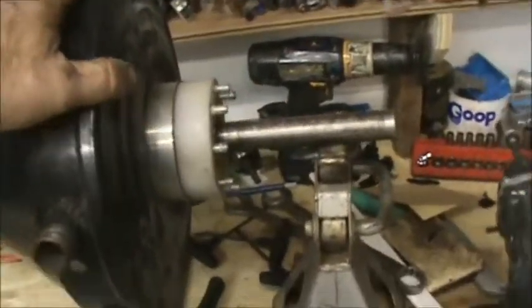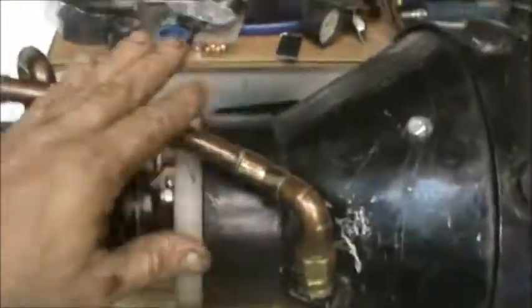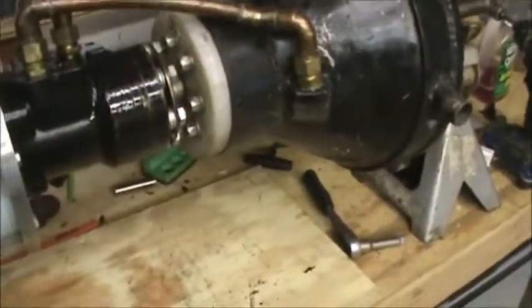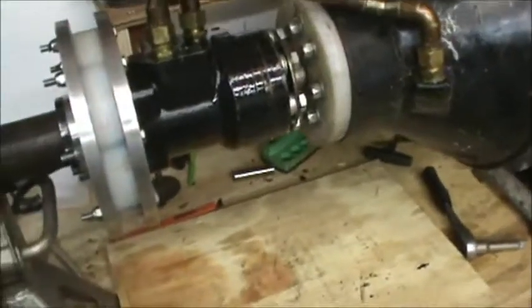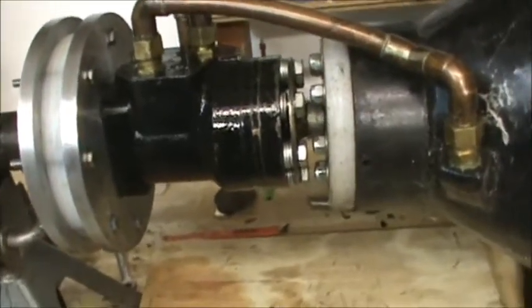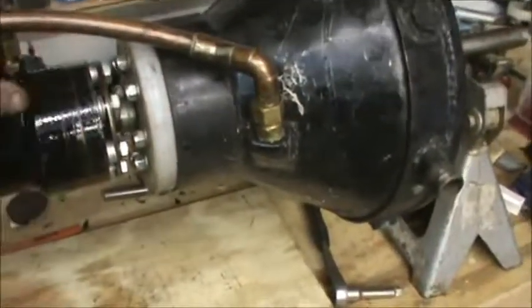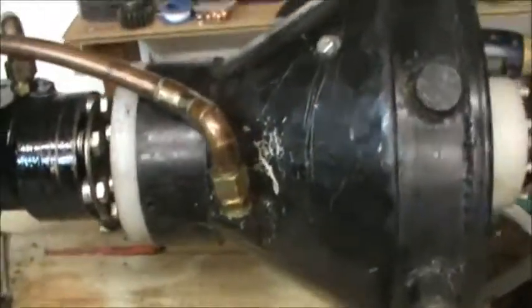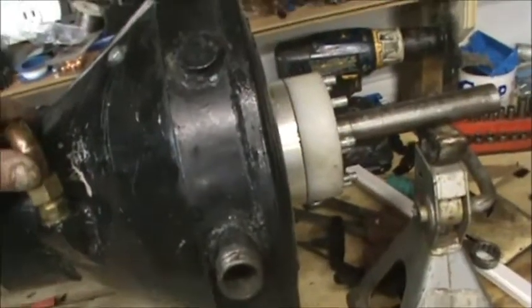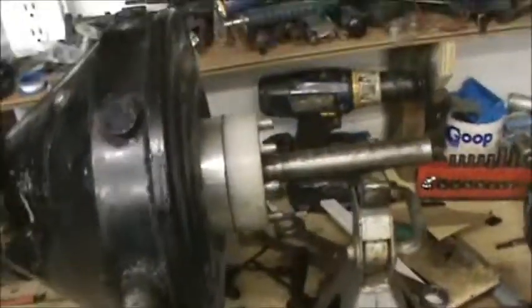Some of the modifications I made are reflected in my latest diagram. I won't need a turbine anymore. What I'm going to have is basically an inner sleeve like this. The base has to be attached to the main frame and allow the hydrostatic motor to spin with the vane pump — it has to be a vane type motor. The output of that vane motor then goes to four individual gear pumps, and each one has its own rim jet.